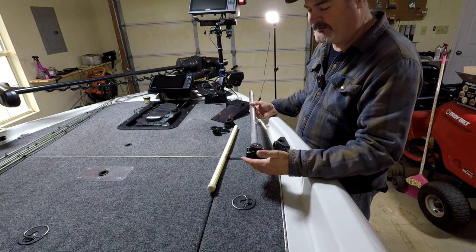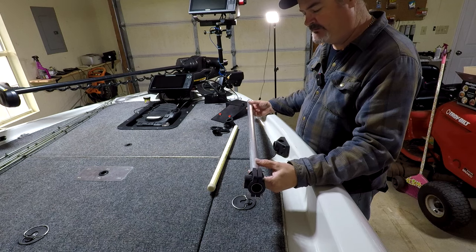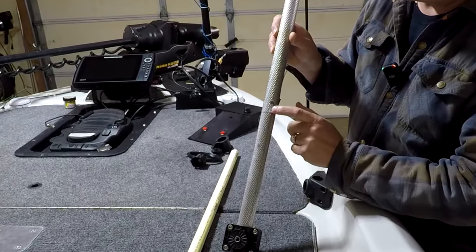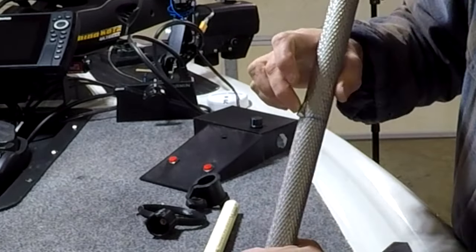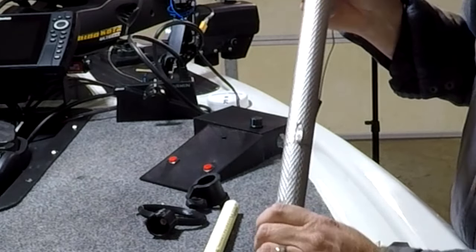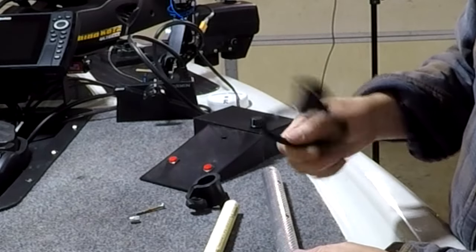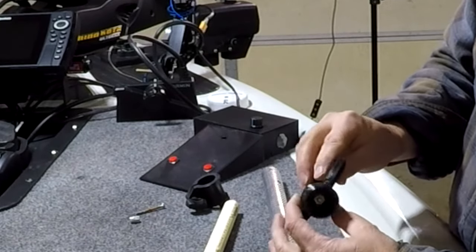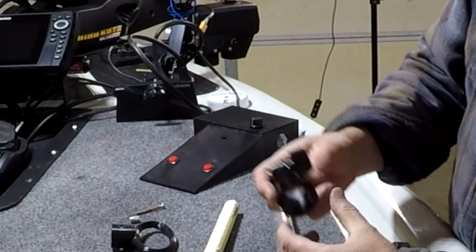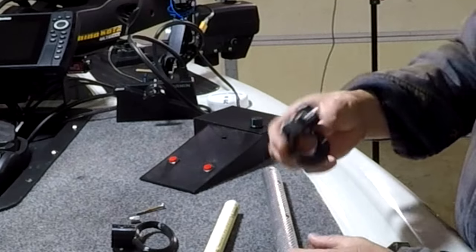I'll put a link to some in the description. It's clamped on and ready to go. The main pole is an inch and an eighth OD thin wall aluminum tube. I got a slot cut inside of it and there's a pawl sticking out with some spring steel in there. I also drilled a couple holes for a handle — I 3D printed the handle, nothing fancy, just something I can grab and pull up on when I'm ready to pull it in. It also helps me know what direction the transducer is pointed by looking at the handle. This is the steering collar that mates up with the motor.